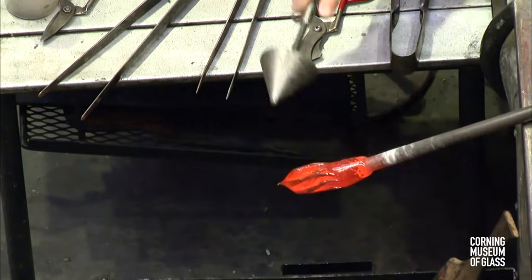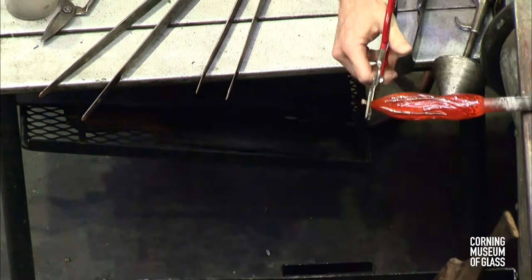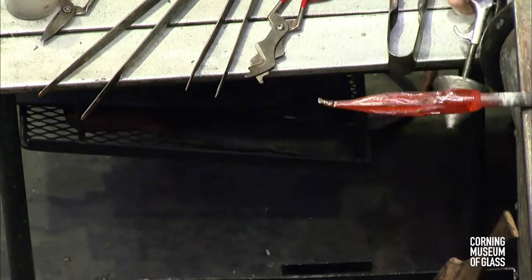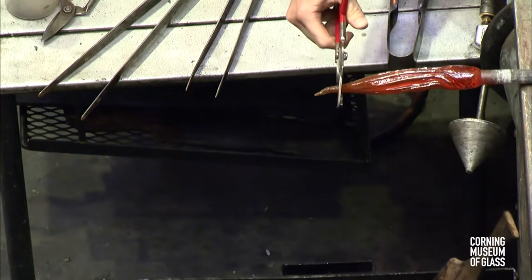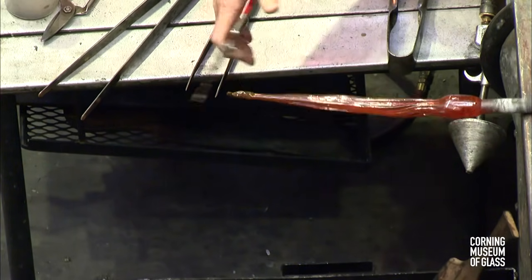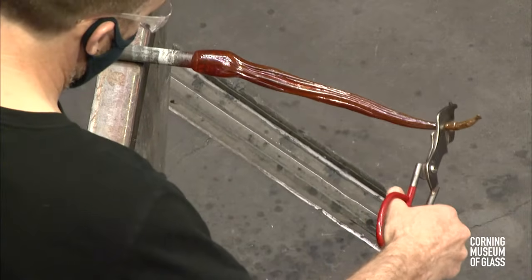And then more recently, it's very important in our world today because it's the glass that makes up the very core of optical fibers, which were also developed here in Corning, but back in the 70s. Three scientists discovered that the fused silica and another high purity glass in combination allowed them to travel the laser light signals through the fused silica really directly and over longer distances than the copper wire.